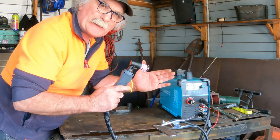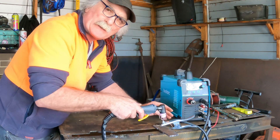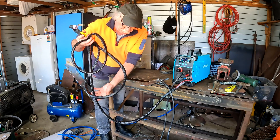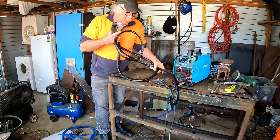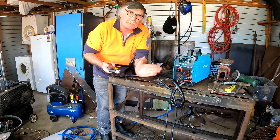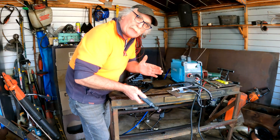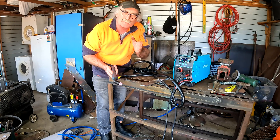That just makes sure we get as much current going into the plasma torch as possible — as close as we can possibly get. A little trick for you: just make sure you've got your leads running away from where you're cutting because all the sparks are going to go down here. If I've got my lead hanging underneath, I'm going to burn through a nice new lead. And that would probably really, really annoy you. I've done it several times, trust me.